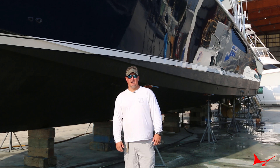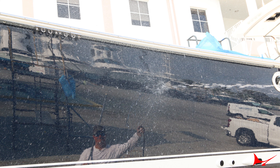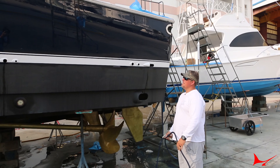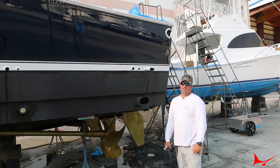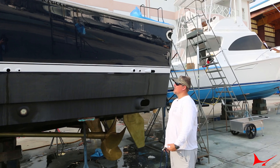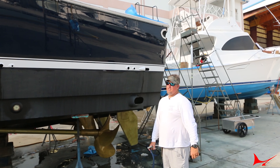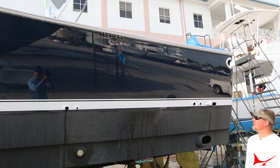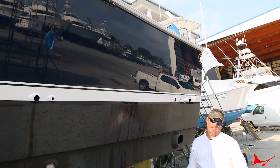We just washed it this morning for the first time and we're in a yard, so obviously the boat gets very dirty. And everything just wiped right off — it was super simple. We hit it with a light brush and all the streaks and everything were gone. With the coating on there, it makes a super smooth surface. It ends up being what they call a hydrophobic surface, so as water gets on it, the dirt wants to be in the water more than it wants to be on the hull. So it helps keep your boat clean — when you spray it, the water captures the dirt and basically sheets it off the hull. Just like wax, but it lasts much longer.